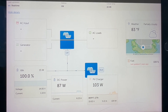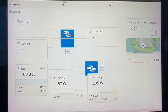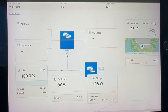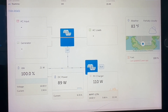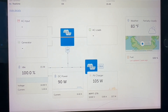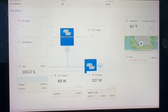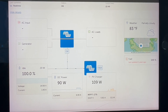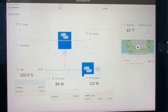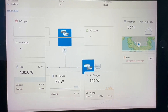I don't want to put the solar panels on the boat at the moment because I'm using them for the house — we're getting into hurricane season. But with a long extension cord I'm able to run these systems on the boat. Right now the boat is drawing 87 watts and the solar panels are running it. The transfer switch is installed so as soon as the battery power drops to 13.1, which is 30 percent, the transfer switch comes back to the house. Most of the day until 4 p.m. or later — you can see that clock showing 3:50 — we're still drawing 110 watts and running it all off the sun for free. Perfect system.